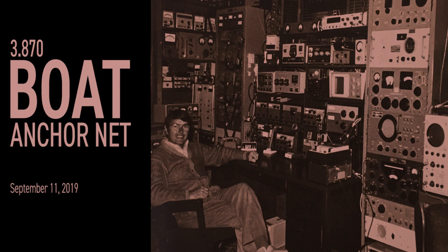I'm talking about a 27-year-old little bitty radio, but it's not a boat anchor. It's a Kenwood TS50, and I'm driving a boat anchor, which is a modified, souped up Heathkit SB 220 amplifier. It's putting out about 1,400 watts. It'll do over legal limits because it's got that big Peter Dahl high current transformer in it. The antenna is a 2-band bazooka up about 35 feet, and the mic is a Shure 444D, and that's about it from here.